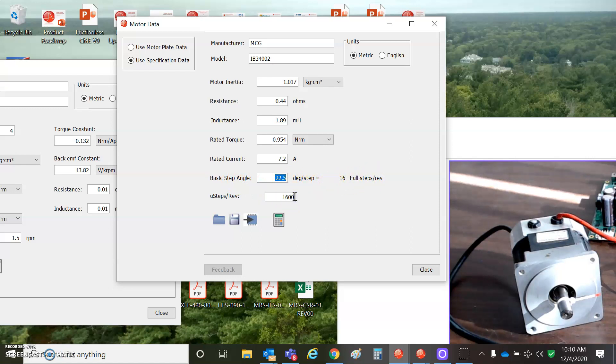Rather than control it in a full-step manner, I'm going to multiply by 100 to get 100 microsteps per full step. This could be 1,000 — it's a relative number, just microsteps in between the full steps. If you had a 4,000-count-per-rev encoder, you could put 4,000 or even 40,000 microsteps here. There is a possibility of doing encoder corrections, but if you have a servo motor with an encoder and maybe some Halls, why not just drive it in servo mode? Anyway, this is sensorless — that's why we're doing this with no feedback, because somebody chopped off the feedback. This is not position control; it's not very stiff when holding position.